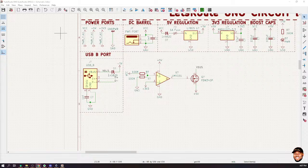When we use capacitors, in a way, yes, we are filtering, we are trying to shunt or absorb those high frequency signals, right? Those signals may not necessarily be spikes. They could be something that is coming continuously. A spike is supposed to be a transient kind of thing, something that is not happening continuously, but happens once in a while and is not actually needed. With capacitors, the spikes we are talking about are usually part of the signal. But transients usually just come from nowhere, superimpose themselves, and cause our voltage to spike or rise temporarily.